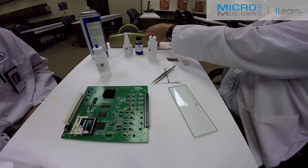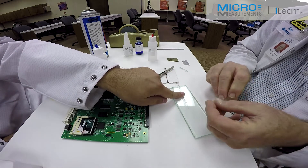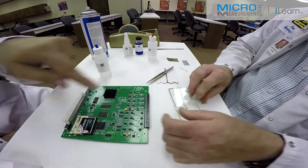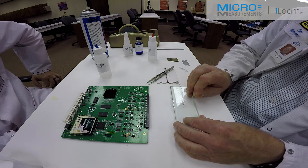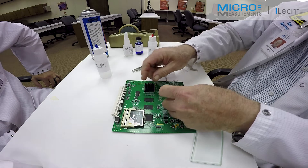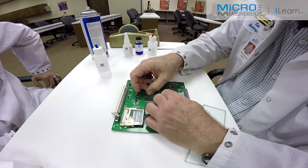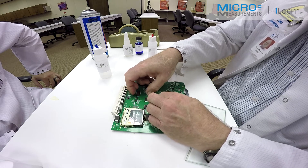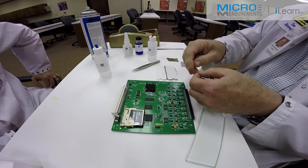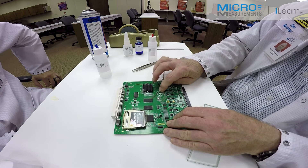I'm going to take some of the MJG2, the Mylar tape. With the assistance of my colleague Colin to hold down the gauge, I'm going to put the tape transverse to the long axis of the gauge due to alignment. Then at a shallow angle, I'll pick up the gauge off of this surface and transfer it to my bonding surface on the circuit board itself. Note I'm being very careful not to damage the fairly fragile lead wire interface. Positioning the gauge where I want it, I'm also going to take another piece of Mylar tape just for cheap insurance, to hold the lead wire down so I don't yank the strain gauge out of position prematurely. This helps to stabilize the gauge installation.